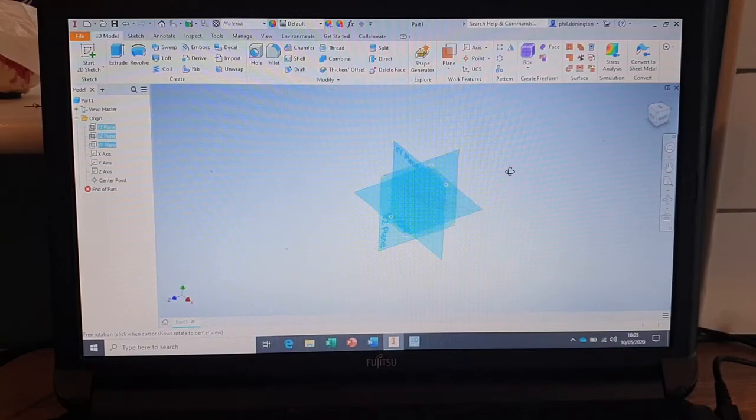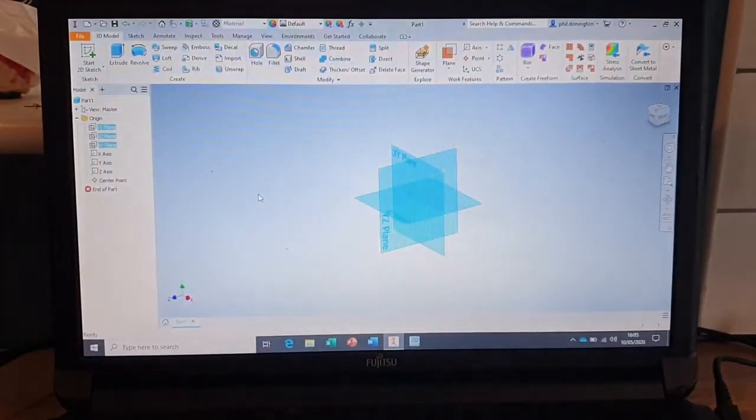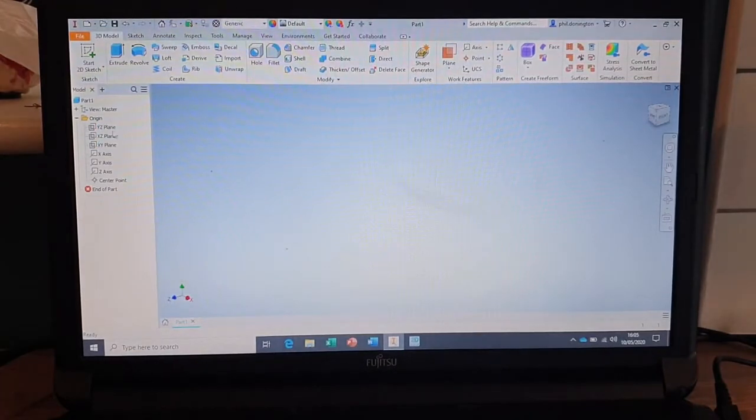Essentially these work planes are pieces of paper floating in midair. They are your starting points. And you need to think about what you're trying to build before you click one to start a sketch. So for the one that I built, I would start in the top plane, or the floor essentially, to build up that sort of C-shaped part. So I'll show you how I did that part to begin with. So I click XZ plane. That's literally the first step. So step one, click a plane.